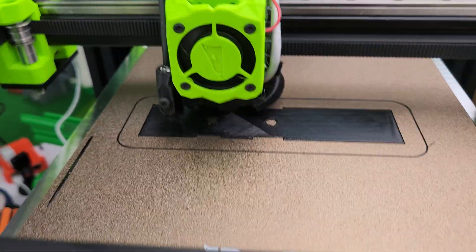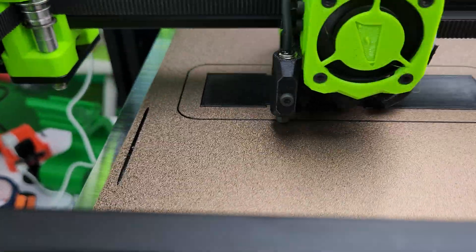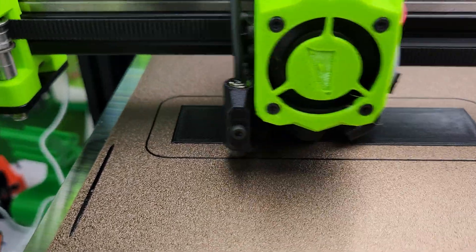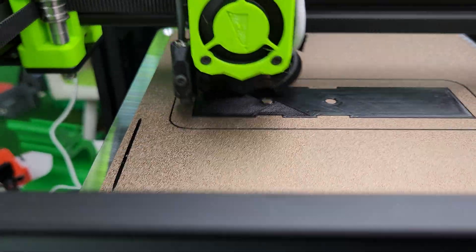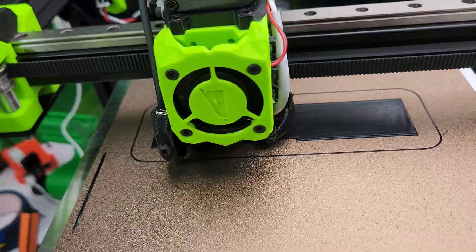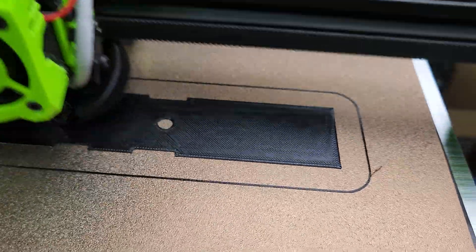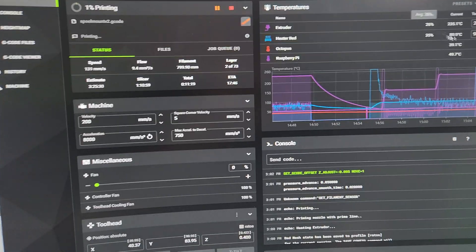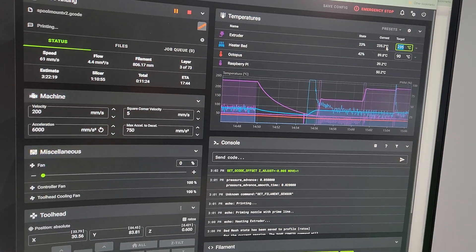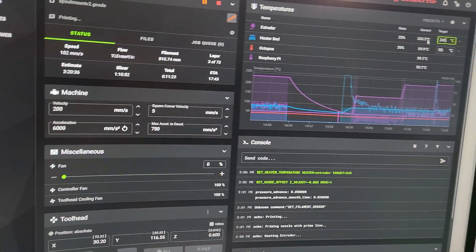Now it's at like the second layer. Oh my god, that thing is fast. It's doing the second layer at 8K acceleration. I just wanted to push this real quick — I want to get faster quality prints. I think I need a little more temperature there, around 235. So I may up the temperature. Mainsail, which comes with it, allows you to change variables, so I might try 245. Okay, that's going to change it to 245.